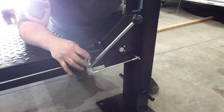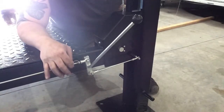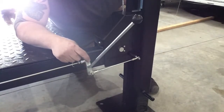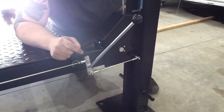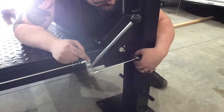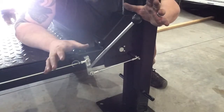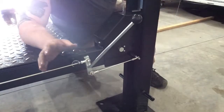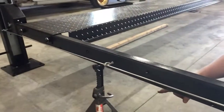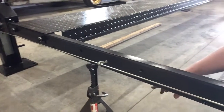Right here is the safety release for the lock. There's a longer thin rod that goes across to the other side. The bolts that go through here do have a little spacer behind them, and then there's a lock screw bolt nut. There's also a short rod that goes across, and on the inside you've got a thread into the release mechanism. One thing to be careful of as a safety precaution: have a safety jack or something underneath, like we have here, just in case someone would happen to hit that release. There are no hydraulics set up to this, so make sure you have some kind of safety in place.